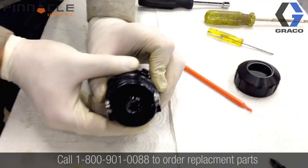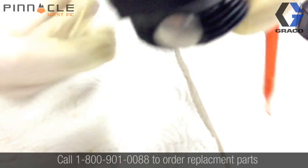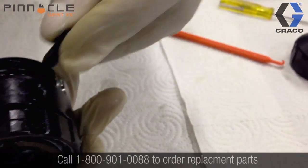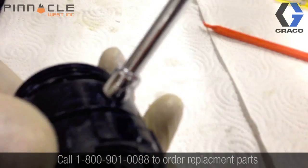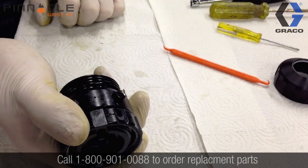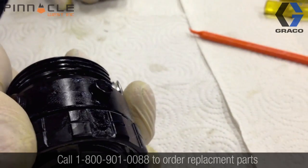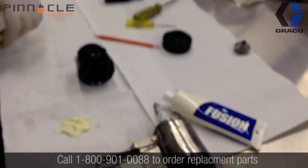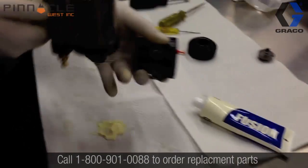In the fluid manifold, we want to make sure that we have our o-rings inserted back into the manifold body. We also need to reinsert our air knife fitting. With the air knife, we generally start by bottoming that fitting out completely and then coming back out about a quarter turn to make sure we get some airflow — we'll adjust the air knife once we actually start to use the gun to get it into the perfect position. Now we're going to take the main fluid section and slide it onto the gun body over top of our already-installed mixing chamber.